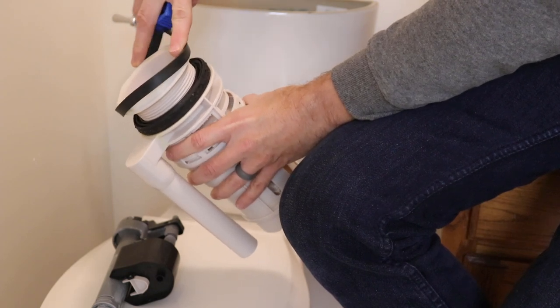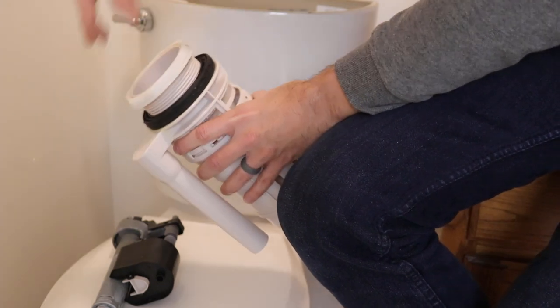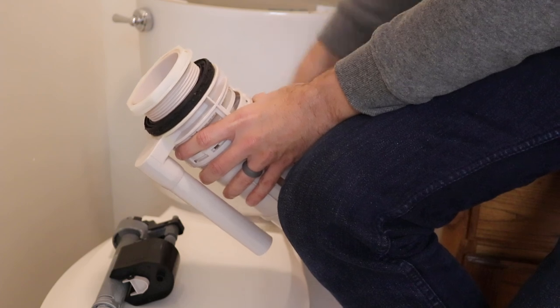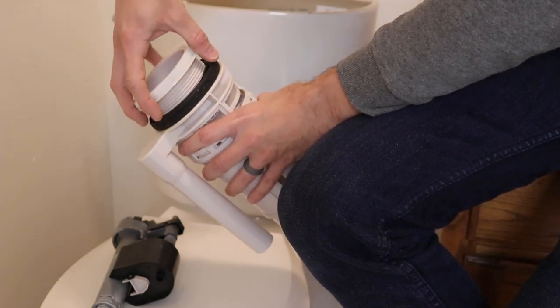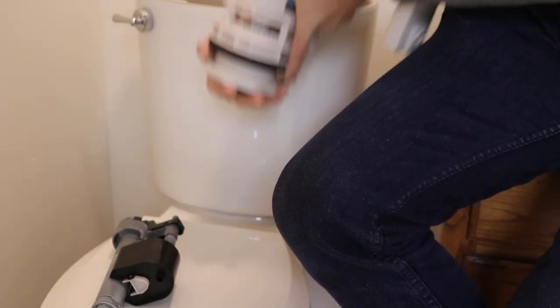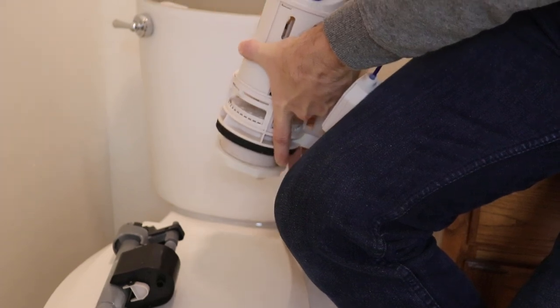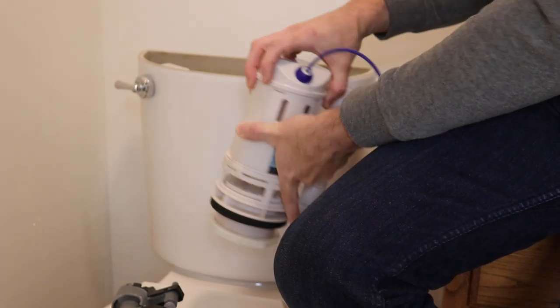my Craftsman oil filter wrench to get around it. This thing is on there pretty hard, so as long as you can get it started, you're in good shape. This has a rubber ring around it, and that's actually what is connected — this is what actually touches the bowl part. That's the only hard part to get out, and then this whole mechanism slides up and out. You put the new one in, make sure you're sliding it forward to avoid the embossed part, and you're in good shape to reinstall. That's how you get rid of the hissing.